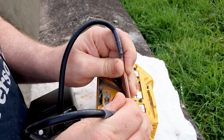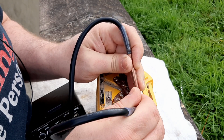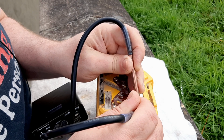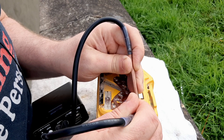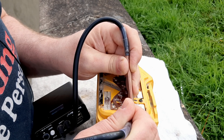I always like to set my spot welder for the 2-second delay — it gives you time before it makes the final weld. I like to put plenty of little welds. You can buy better spot welders; there are more sophisticated ones than I have, but I find this one's just fine.